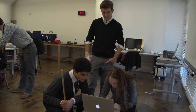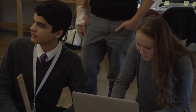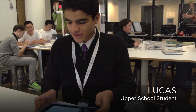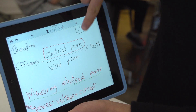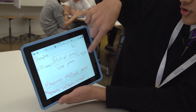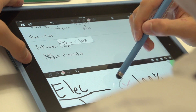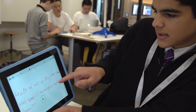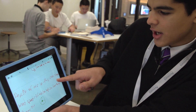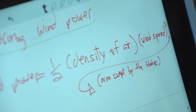So it's .002556 — that's pretty good. There's a lot of math. The efficiency is the electrical power over wind power times 100 percent. To find electrical power, you multiply voltage by current, and that is done by the computer. What we do have to do is find the density of air and the wind speed of the fan, then plug those into the equation.